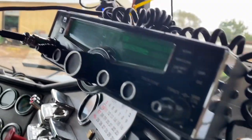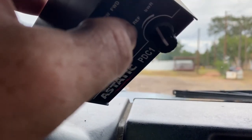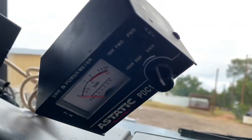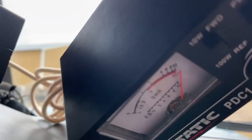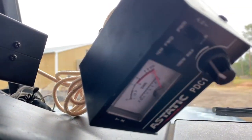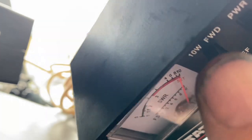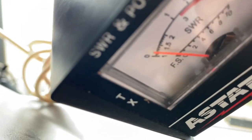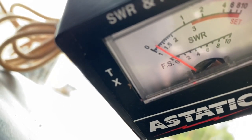Let's take it back to channel 40. Move it back to 10-watt forward. Key the mic. Check our adjustment — we're right on the meter. Flip it and see where our SWRs are now — they are about 1.2. Big improvement from the 1.8 we had before.